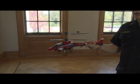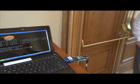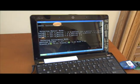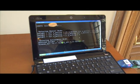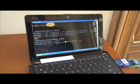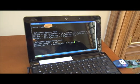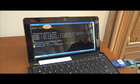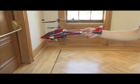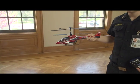So now we can see on the screen it says it's in autonomous mode, and it's showing the desired height, which is the height at which the helicopter was when it goes into autonomous mode. The trans-X DC measures the X direction translation, either positive, goes up to one, or negative with zero crossover. Same thing with the Y direction. You see the numbers increasing and decreasing.